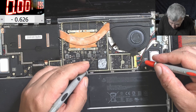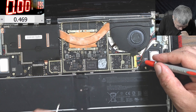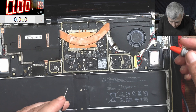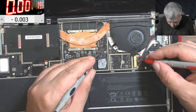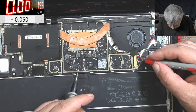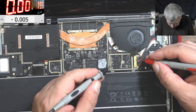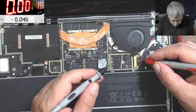Power supplies — those are power supplies and we have nothing. And we have nothing. Where is the battery connector? I can see the cable here, so probably it's going on the other side of the board. Here we have capacitors and we have nothing, and here we have nothing. So basically we have no voltage on this motherboard, which is strange because we have the light on the charger. We have 15 volts here. So those are MOSFETs or what? Let's check together.